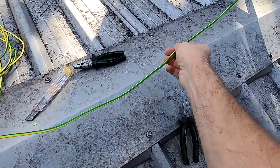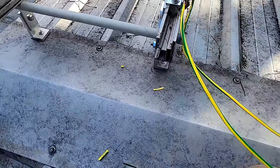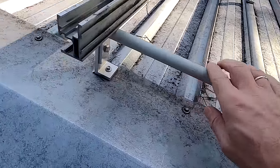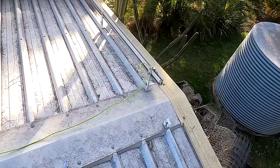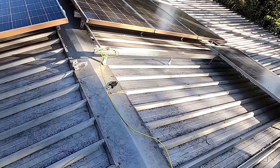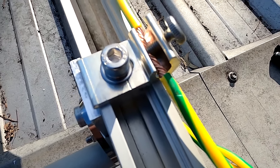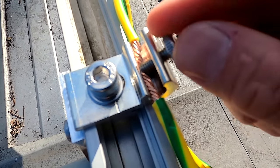Now I have enough slack in this cable here to get this organized under the solar panel later on. We just continue doing that - we feed the cable through this conduit, which is the exposed area between the solar panel strings, then attach it and do the same loop. Here's our earthing system - it goes from one earth lug to the next one. And this is exactly the corrosion problem they were talking about, because the copper is now exposed to the air and will just turn green, which obviously prevents good contact with the earth lug.